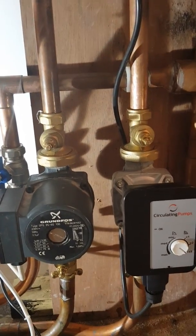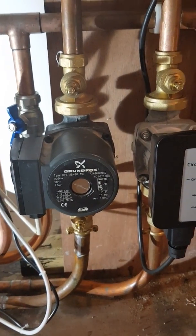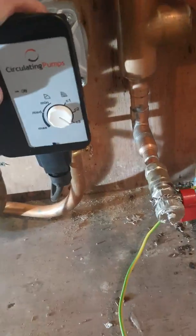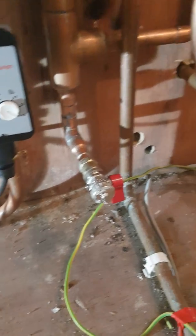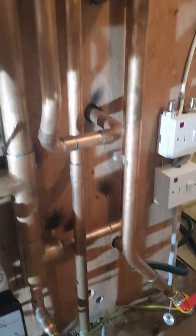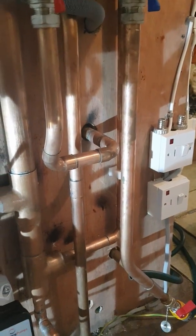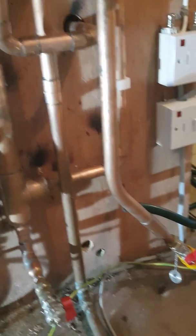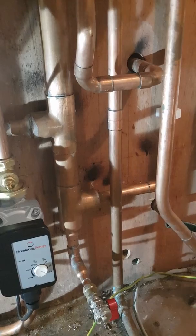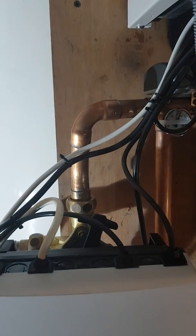Just enough space to pop on my pumps there. I think if I'd had two Grundfos pumps, I might have had a bit of a problem squeezing the connection box in — I'd have to tilt it at a bit of an angle. And a rapid drain point on the base of my header, drain point on the lowest part of the cylinder, flow and return there. Now I picked up a lot of this off of the old pipework from the old boiler, so these aren't actually the positions I'd have chosen to go through to next door. And I hasten to add that these burn marks on the wood are not from my soldering.